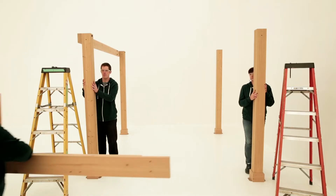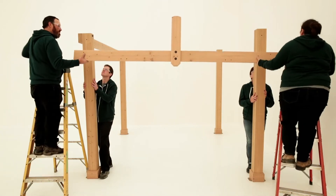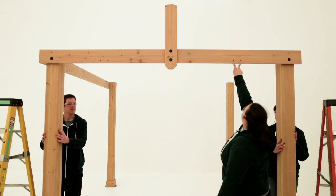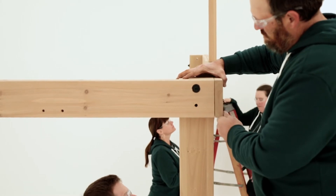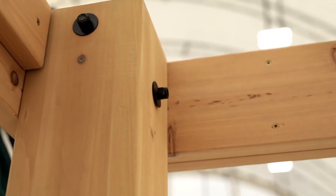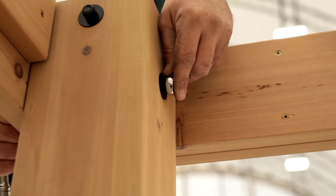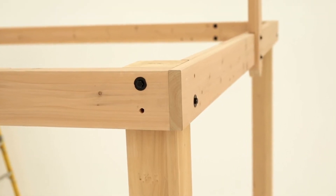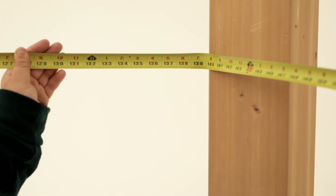While one person remains holding the side frame assembly, have a second person stand another post. The remaining two people should lift one gable beam assembly into place so the gable inside faces inside the pavilion and the gusset holes are along the bottom of the gable beam. The beam should be flushed to the top of both posts. One end should be flushed to the edge of the side beam assembly while the other should overhang the posts. When in place, attach the gable beam to each post using one hex bolt per side. Repeat to install a second side beam assembly and a second gable beam assembly. When you're done assembling the frame, check each of the measurements listed on page 17 of your instruction manual. The structure should measure 11 feet 7 and 1/8 inches diagonally between posts in both directions.